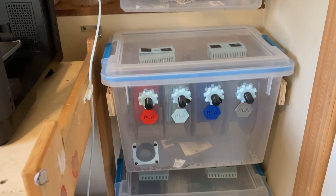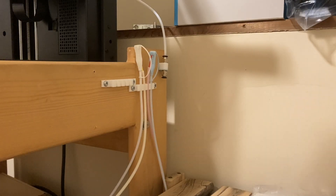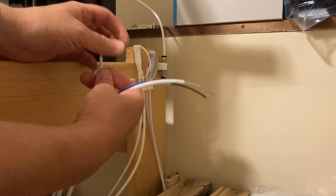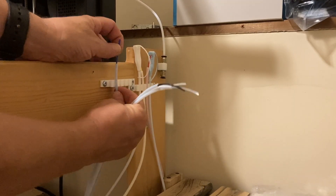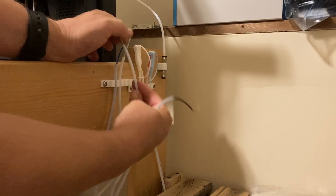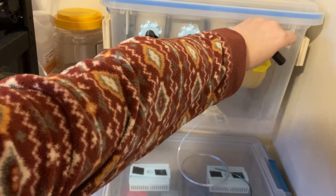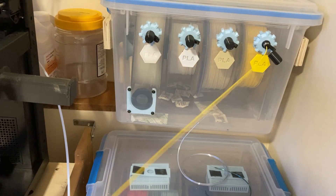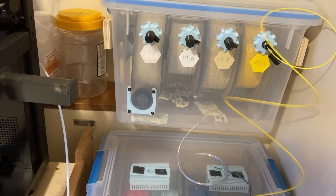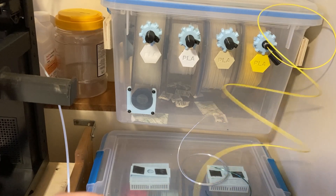The boxes are thus held slightly apart and I can crack open the lid. I originally wanted to have PTFE tubes going to each filament fitting, but that became messy with the 4 boxes and 16 fittings. So I decided to simply move the main PTFE tube from fitting to fitting as needed. This means that to load filament into the printer I do need to feed the filament through the whole tube, which is a good meter and a bit in length, but it really just takes less than a minute.